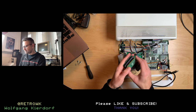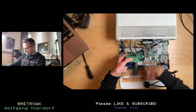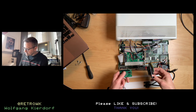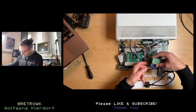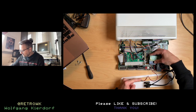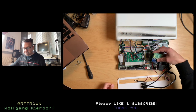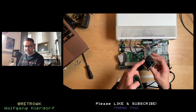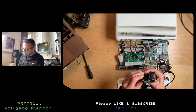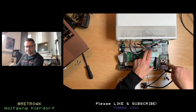I put in one of these GPIO extenders, because if I plug the Pi into the RGB-to-HDMI board, this HDMI connector pushes against the backplate and I can't connect anything. Even if I remove this and plug in the connector directly it doesn't work. So I'm using this GPIO extender — it has three of these but I'm just using one — plugging this in here, and like this I get a little bit more room and can actually angle this thing.